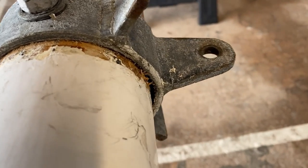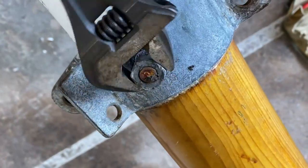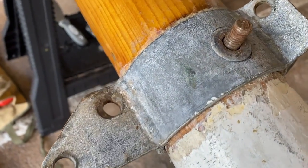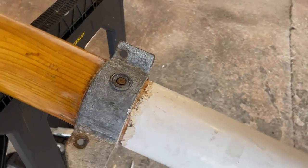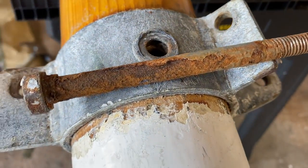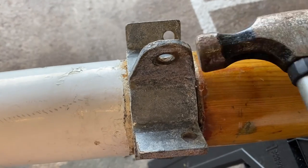The other side of it - all solid wood. This is looking great. I am going to take the mast band off, which means getting those 35-year-old nuts loose. They come off pretty easily; I didn't need a spanner on the bolt but the nuts were easy to get off. Just need to get the bolt out now - a good smack with the hammer should sort that out. So here it is: a 35-year-old galvanized steel bolt, a little bit of surface corrosion admittedly, but I don't think that's too bad. That all bodes quite well for what's going on inside the mast. Clearly I'll replace that one.